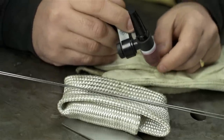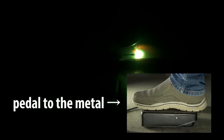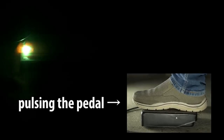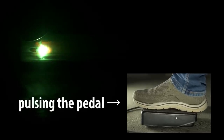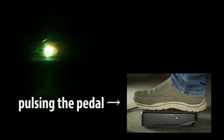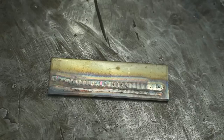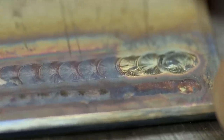Let's take a look at what that looks like. First, here's constant amperage. And this is manual pulsing — me being your dad with the gas pedal. Giving it more gas, easing up, giving it more gas, easing up. For the same exact settings on the machine, some fancy footwork or playing with your travel speed can net you some different results. This was with no filler — adding some filler can blur the lines a bit. But here we're talking about the behavior of the arc.